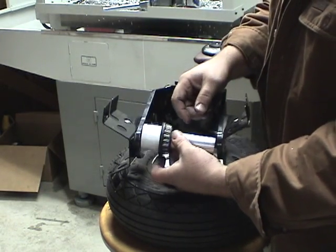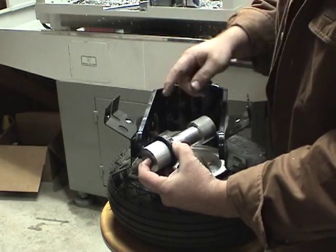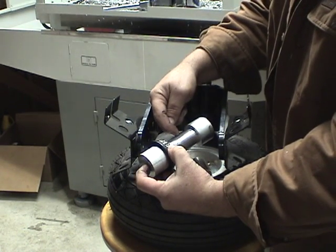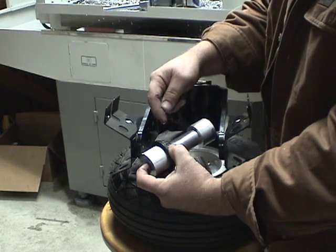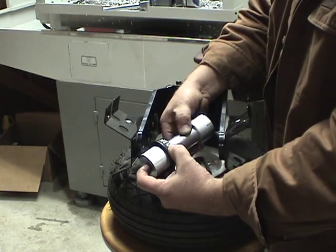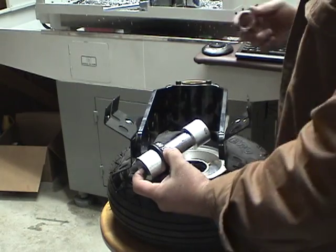What we've done too is we've designed the whole system so that when this is together and you've tightened on these bearings with the correct amount of torque on that bolt, there's about a sixteenth of an inch on this bottom axle for it to float. So there's no possibility, unless you really over-crank this thing, to bottom out on this yoke — so there'll be a little bit of play. That's really all there is to it.